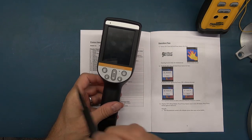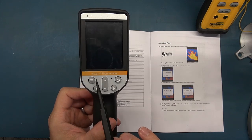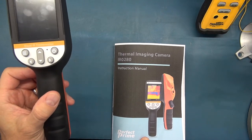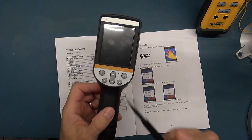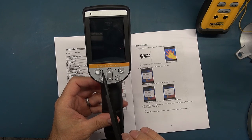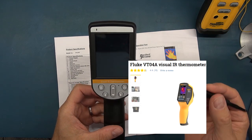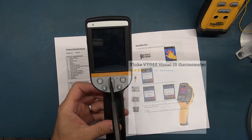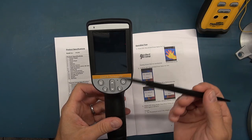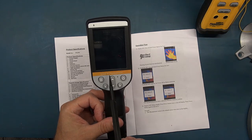The naming of this is interesting. On the device they call it a 'visual IR thermometer,' but on the cover they do call it a 'thermal imaging camera.' The Fluke VT series used the 'visual IR thermometer' label because they didn't have radiometric data. I would not call this a visual IR thermometer — I'd call it a thermal camera. It is low resolution, but with that radiometric data, it certainly takes it above a visual IR thermometer.